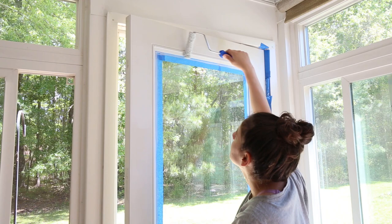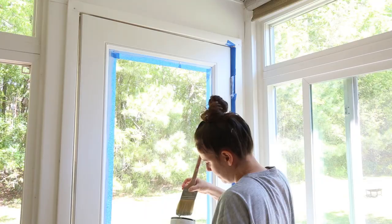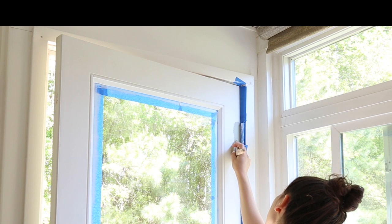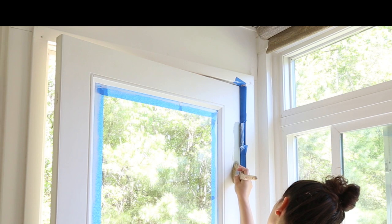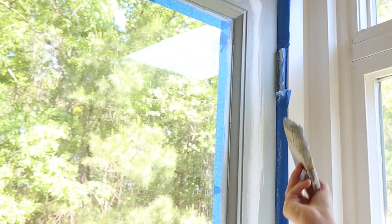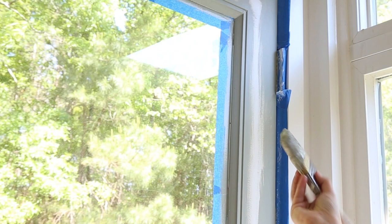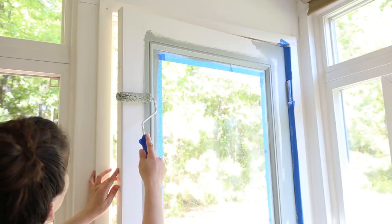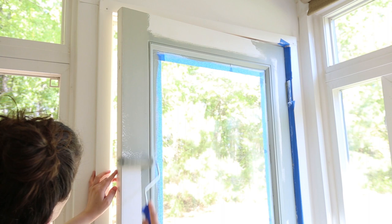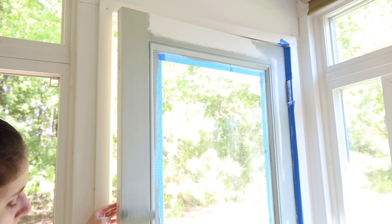The next step is to paint the door. For an exterior door it's best to use an exterior paint. Since I painted the inside of my door and was just using paint I had on hand, I ended up using an interior paint, which is fine if you're going to do it on the inside of a door because it's not going to get wet or be in direct sunlight. For painting the door, use a paintbrush and cut in the edges, corners, and creases again with the paint where a paint roller won't reach easily. Let that first cut coat dry and then apply a second coat cutting in all the edges, creases, and corners again. After the first two cut coats, use a small paint roller again and apply a first coat of paint with the roller. Let it dry, then go ahead and add a second coat of paint with the roller and let it dry again. And then that's it — you're all finished painting.